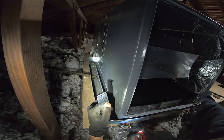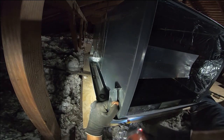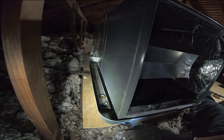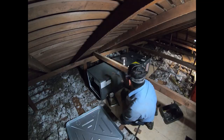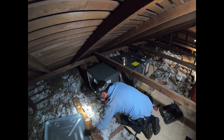Here I'm getting the strap ready — this one's going to go on the actual supply plenum. If I pre-drill the hole and secure the bottom part first, it'll make it a lot easier to screw onto the supply plenum later. Now I'm strapping the evaporator coil.